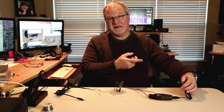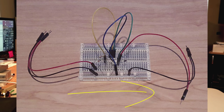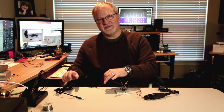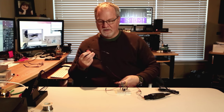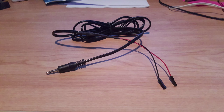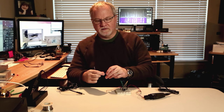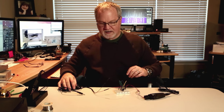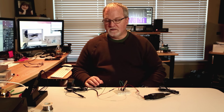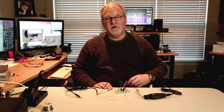This gets plugged in here. Obviously, the USB gets plugged into your computer's USB port. And once the data terminal ready line goes high on the computer to signal that you want to send something in Morse code, it closes this little electronic switch. And now these things are grounded as though you had just touched your straight key. I did a similar thing — I took this 3.5 millimeter cable, cut the end off of it, and I soldered a couple of female jumpers to it so that I could just plug them directly into the male jumpers on my breadboard. Ground goes to ground, and this line goes to the hot side. So now all we have to do is plug this jack into where our straight key would go and plug this into the computer and configure the software.